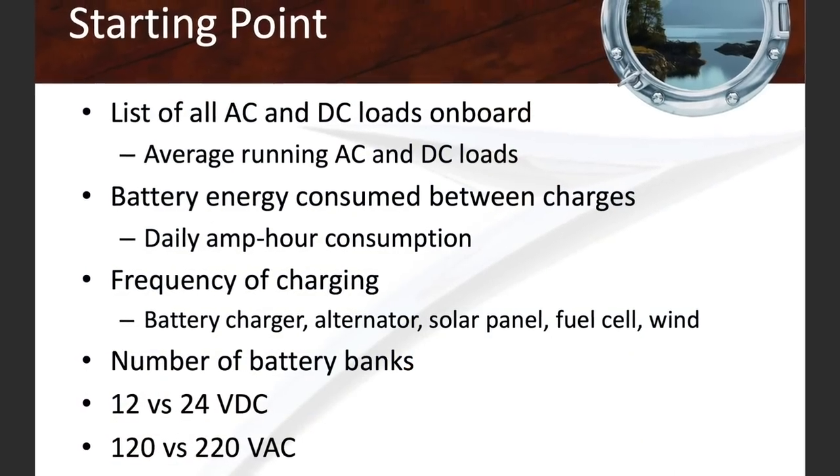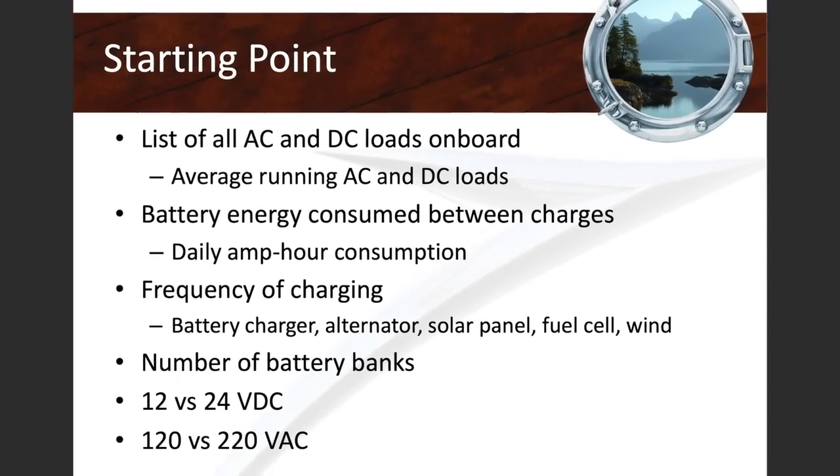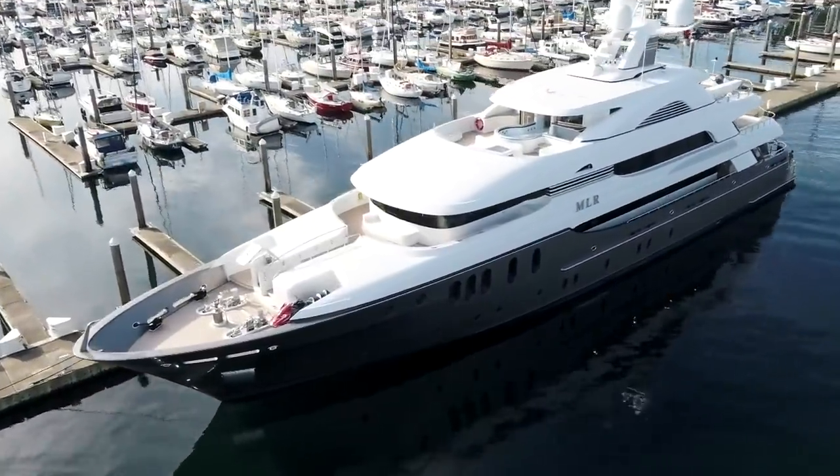If you're building a completely new boat, you might decide: am I going to go 24-volt or 12-volt? Big implication there. We're seeing more and more 24-volt boats, especially above 50 feet. Is the boat coming from Europe — is it a 220-volt boat or a 120-volt boat? Are you going to have air conditioning on board? You can't run air conditioning on just a simple 30-amp, 120-volt system. You might need a 50-amp, 220-volt setup. All these things need to be thought about at the beginning. Always create a plan before you start your journey.